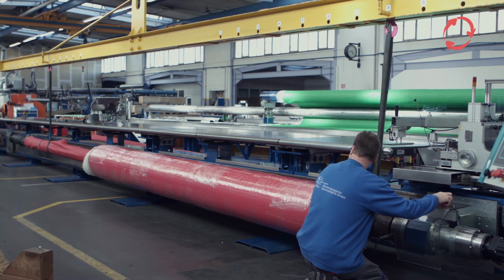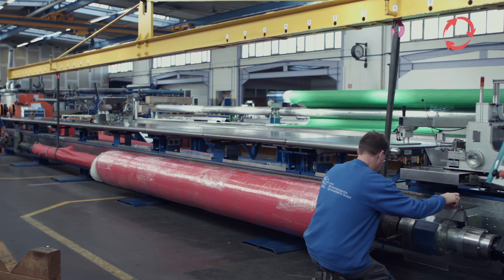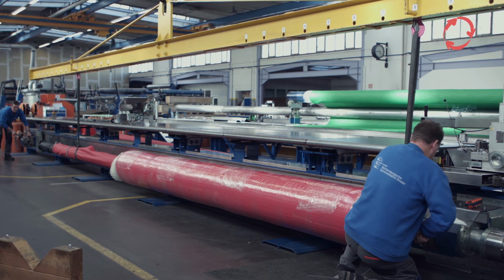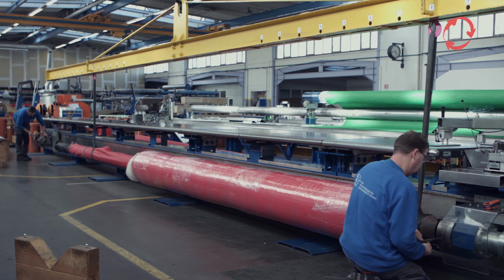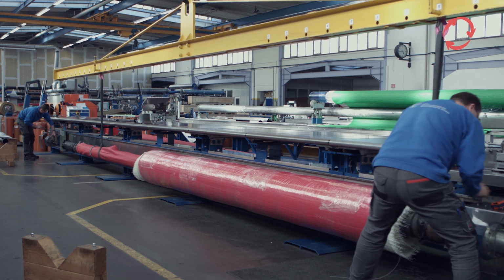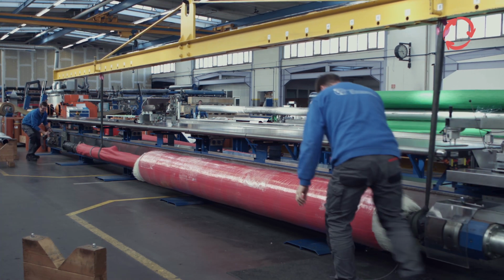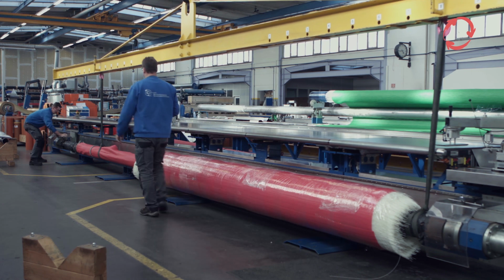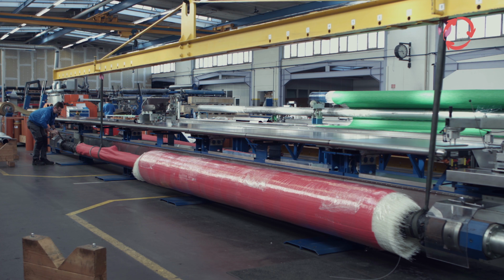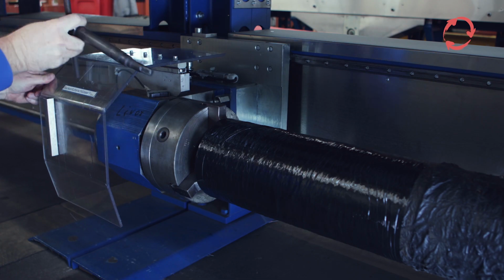After aligning the sieve roller horizontally and gently applying the clamping jaws, the console can be pushed to the winding tube until the clamping jaws are as deep into the tube as possible. The tube may only lie on the clamping surfaces of the clamping jaws. The locking bore with screwing has to be posted at a clamping jaw. The clamping jaws of the console are now also lightly applied. The jaw chucks are then firmly tightened on both sides. The jaw chuck keys are then inserted into their brackets to prevent damage to the system while being wound up.